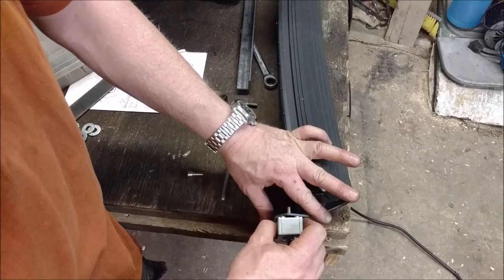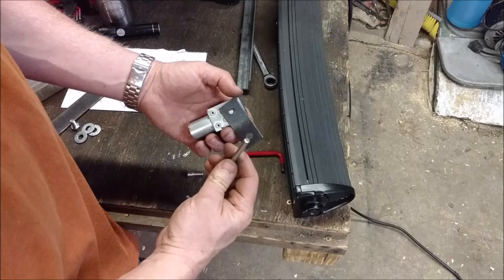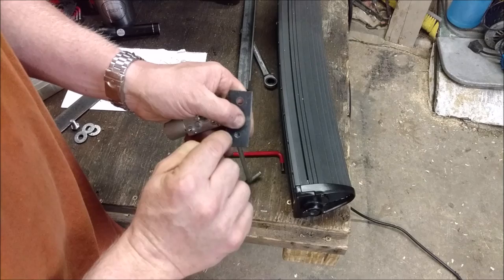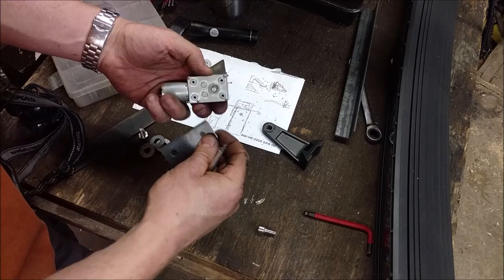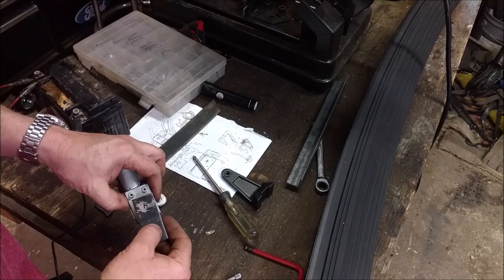But you can see right here we have what's called a D shaft, and we have a round hole. To make a round hole into a D shaft, we're going to take another piece of round rod and grind it down so we just have this little sliver that used to be right there. We're going to insert that into our hole and weld that part to this, so it's a permanent fixture. The D shaft can only go in one way and it's locked to this piece. There we go, just the sliver, the negative of what was ground off, makes a round hole. So we can put that in the round hole, slide this little piece in there, and weld this to the D shaft, so now it fits over there perfectly.